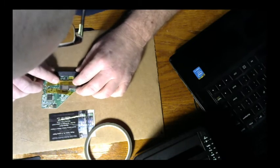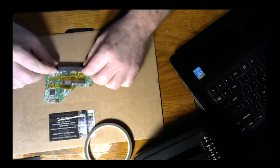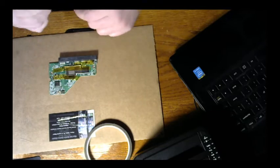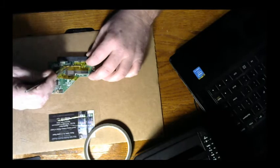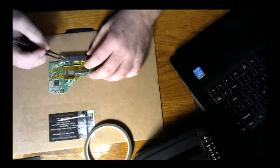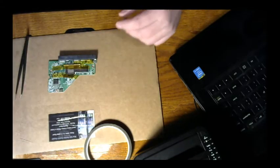That works. And I think Y1 will be fine. Let's see. Right, we're going to bump the heat up on our air gun to about 300 or so, 350. It's 350 degrees Celsius. Alright, very good. Now, I think my plastic fingers, or my metal fingers, so I can just put some pressure on it. And I also have my fine tweezers, which, you know, that's really the bomb diggity there. Let's get started in removing.